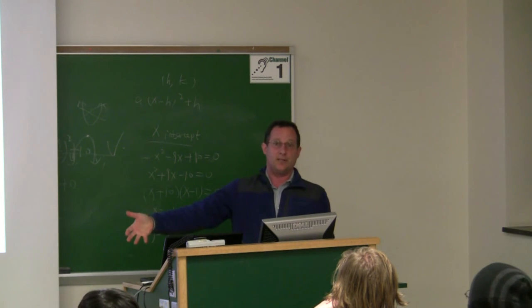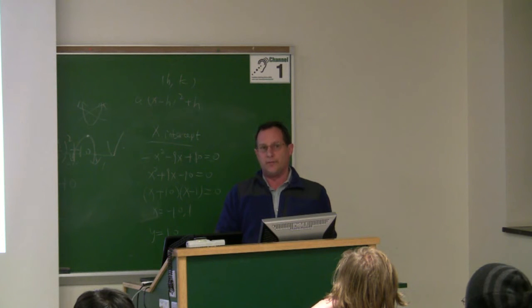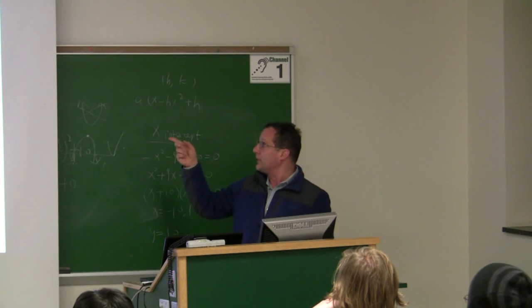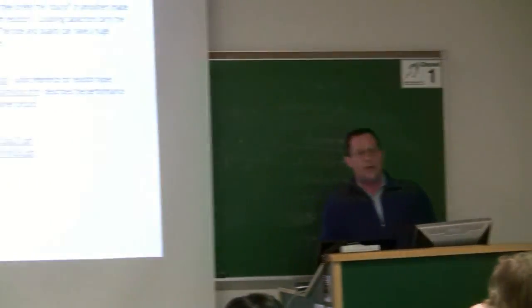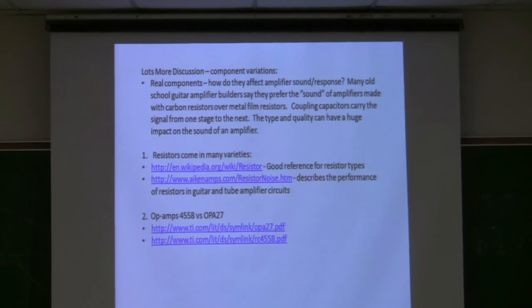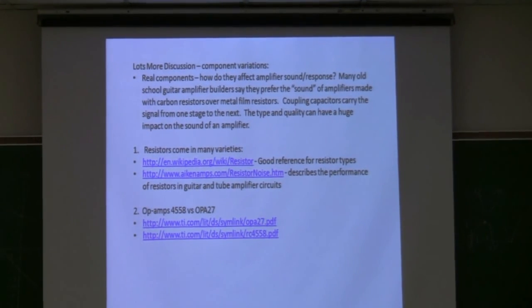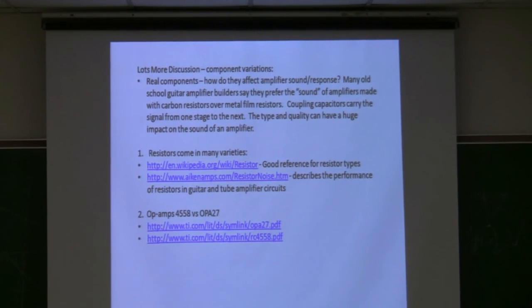Then he did a blind survey, getting audio experts in who could not hear the difference between a $5,000 amplifier and a $500 amplifier that had 10 times the power and cost 1/10 the price. The biggest thing that he changed was the capacitors. So we can talk about capacitors next time. I think they actually do make a difference, because a capacitor is not just a capacitor. A capacitor has effective series resistance, it has dissipation factor, it has all kinds of secondary effects that really change the whole circuit that you're putting it in.